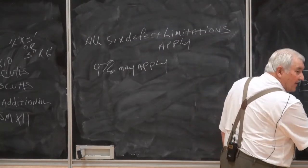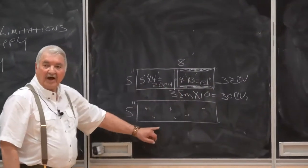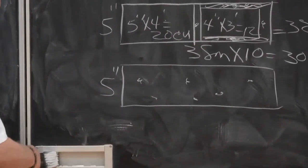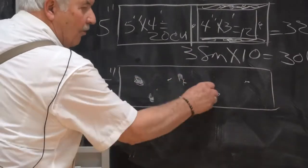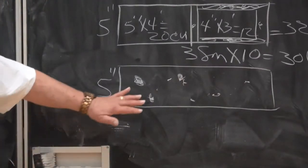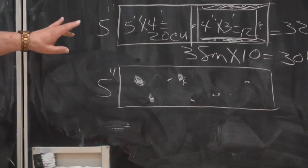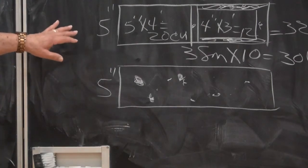You make FAS yield on the better face and the reverse side of your cutting sound. You can have sound knots, wormholes, bird peck, anything that's sound. Now, does that look like a funny FAS one face walnut? It does, but that's what the rule is, okay? And so you make FAS on a better face.